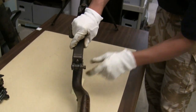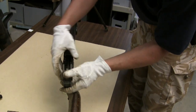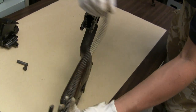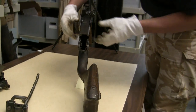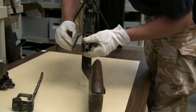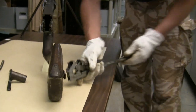Next we have a pivoting pin — pull the cap out, rotate it down, this pin comes out, and then the rear end of the receiver comes off. Because of the offset stock I can pull this straight out the back of the gun. This has basically a very machining-heavy guide for the recoil spring. We pull the charging handle back — this is a non-reciprocating charging handle — then the charging handle comes out and the bolt and operating rod both come out the back of the gun.